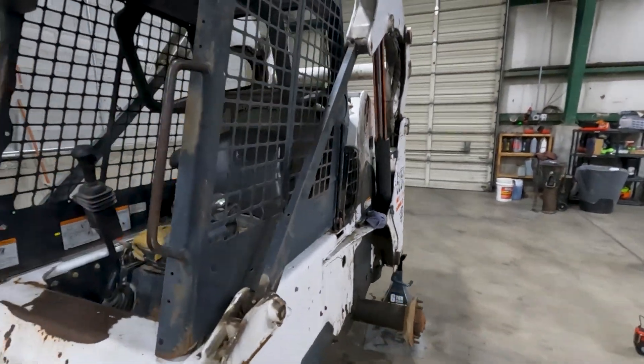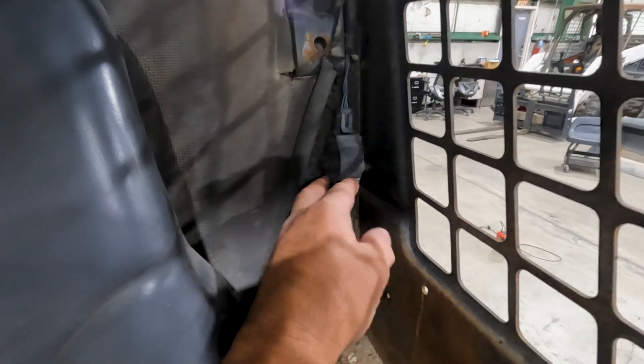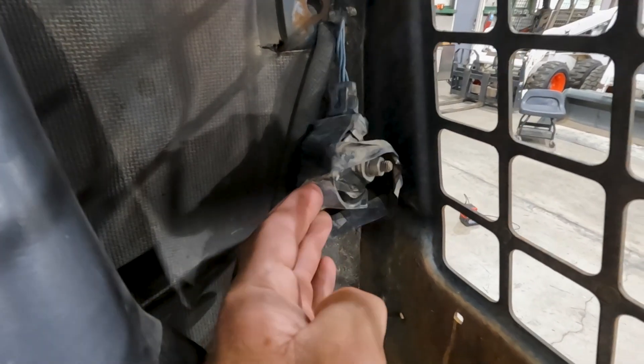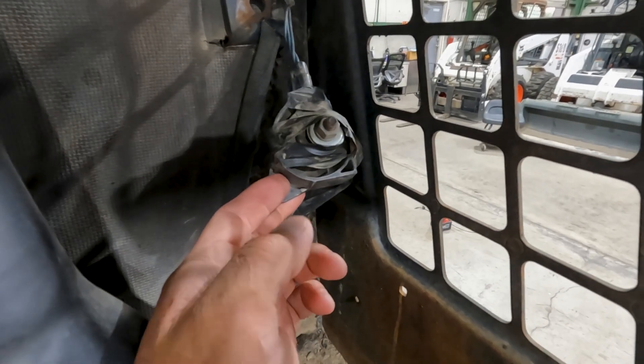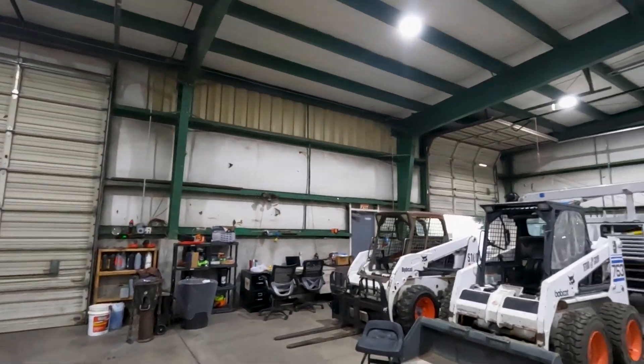I've actually got an example on my old 250 over here. When I picked it up the seat bar sensor was in place and all electrical-taped up — it's not glued but it does have a bolt through the center of it and it's all taped up. It does work, but the machine will operate with the seat bar up at all times. We still have to press the push-to-operate button, but it will work with the arm bar up, which is kind of dangerous. We don't recommend doing that.